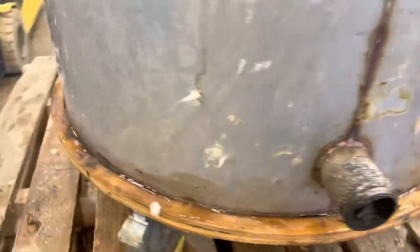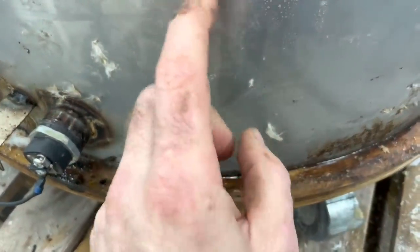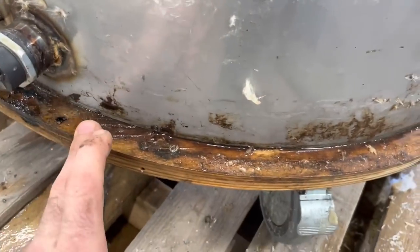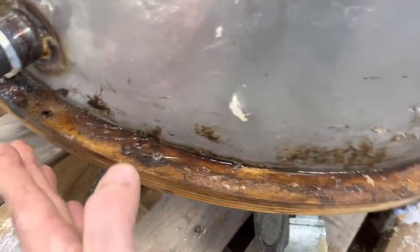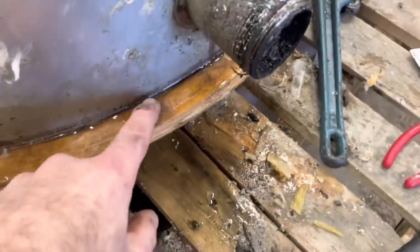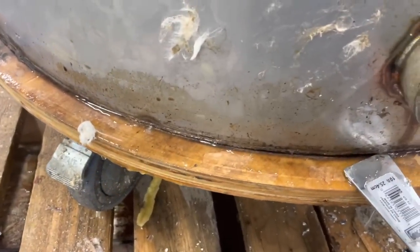What I'm probably seeing is that whenever I change the element here, water is released, or oil, whatever I have in here. And whenever I top it up here and spill, whatever gets stuck behind the sheath falls down onto this plate, and it's trapped here with the sheath on the outside. So what I think I'm seeing is that moisture being caught in and underneath. So then it just continually, every once in a while, leaks out on me.